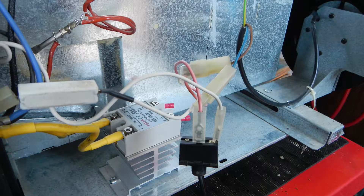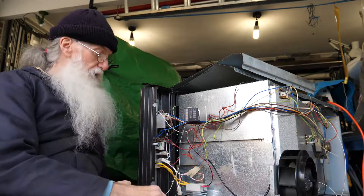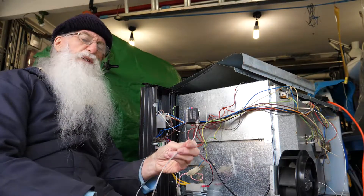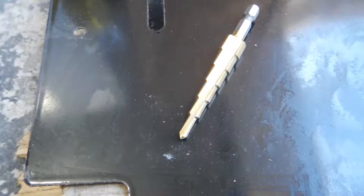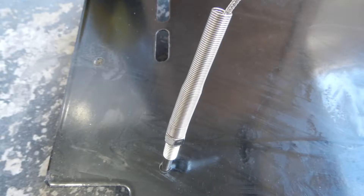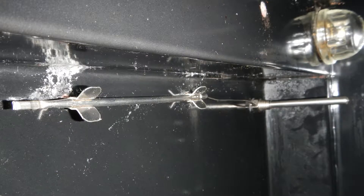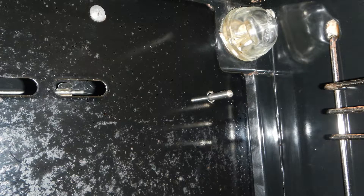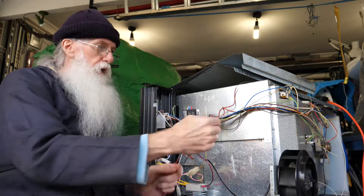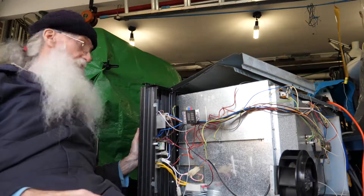This is the fan that cools the outside of the oven — I just tapped into it. So I have a fan switch, temperature controller, an SSR, and that's it. I've also added a thermocouple. You can buy the short type and put it where you like, but I found it was too short — there's insulation between the cover and the main body so it wouldn't fit. As these photos will show, I've modified it to have the 50mm one, so the end of the probe is actually inside the oven away from the cover.